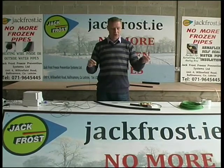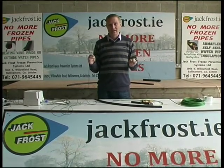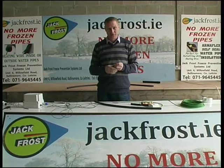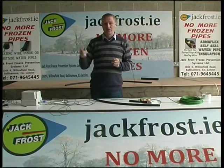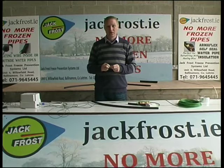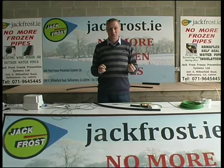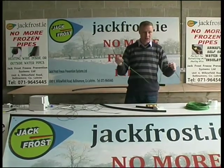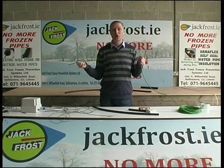Another question often asked is can you cut the wire or join it? The answer is very clearly no. Resistance wire is made to a particular resistance. We send it to you made and sealed so that it will not absorb moisture through the end joint. You cannot cut it, you cannot join it — you must measure accurately the distance you need. The length of wire you need will be the same as the length of pipe from underneath your sink or your hot press, wherever it first enters your house, out to the mains. Measure it accurately — give yourself a metre or two to spare, but certainly don't be short. The Jack Frost Ice Guard wire similarly cannot be cut or joined. It comes in specific lengths: 20 metres, 25 metres, up to 135 metres.